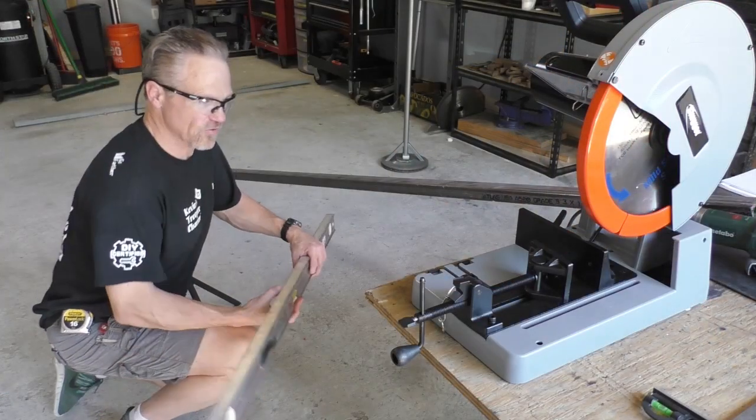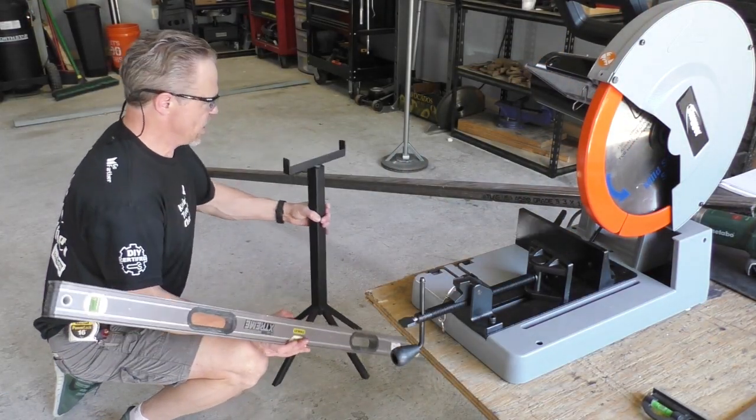One of the really neat things that I've learned by watching some of the professionals on YouTube like Jimbo's Garage and Chucky 2009 and WeldingTipsandTricks.com is the order that they do things. They all have a tendency to cut all of their pieces out first, or at least most of them, and get it all set off to the side. And then, once they start leveling and tacking, they have a bunch of pieces and they're able to put it all together very efficiently.